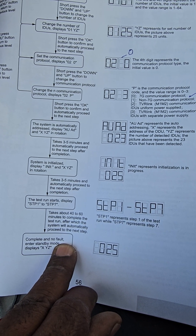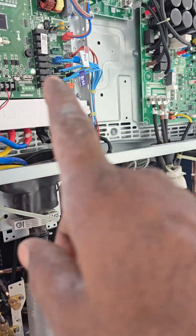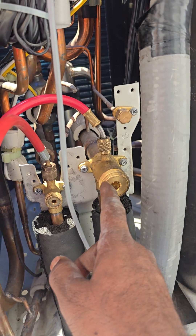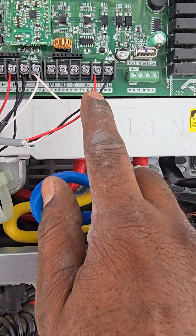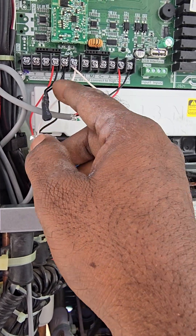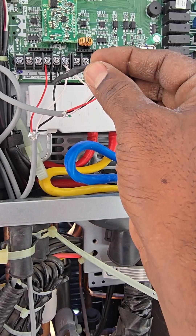At this point we only power on the indoor units — we do not start them from the indoor units themselves. The system runs automatically from the outdoor unit. This machine has a master outdoor and a slave outdoor, both of the same capacity. We also open the wall panel. The H1/H2 terminals handle communication from master to slave outdoor. For better communication we install a termination resistor on PQE connections, and the same resistor is installed on the last indoor unit.